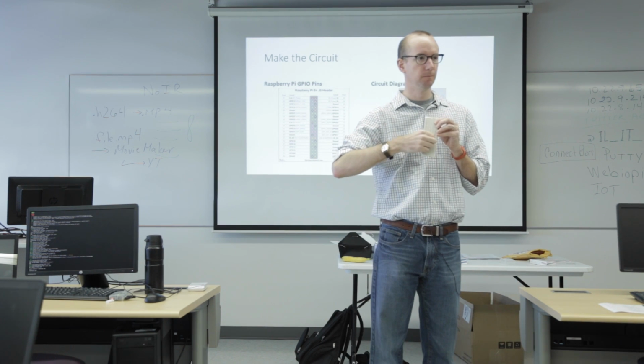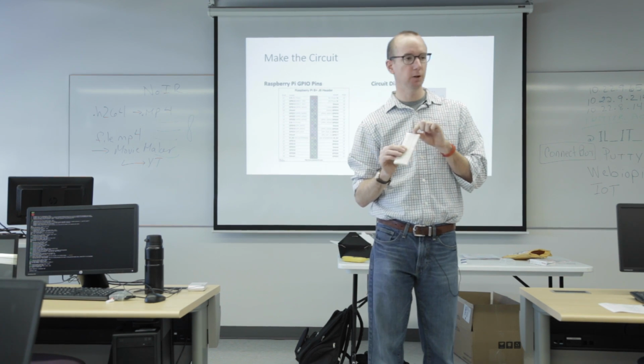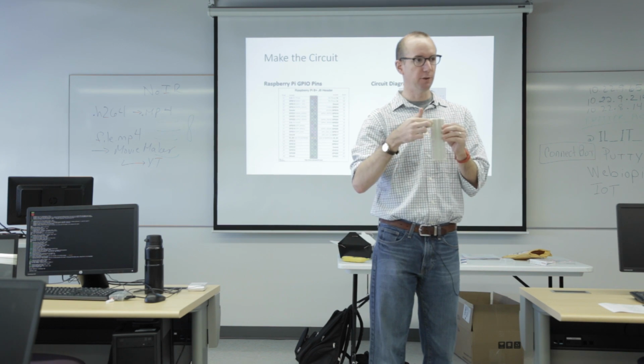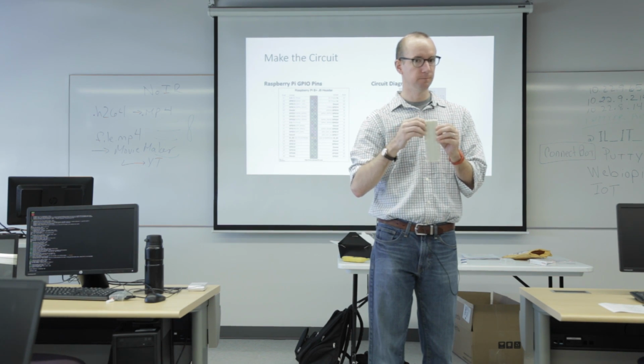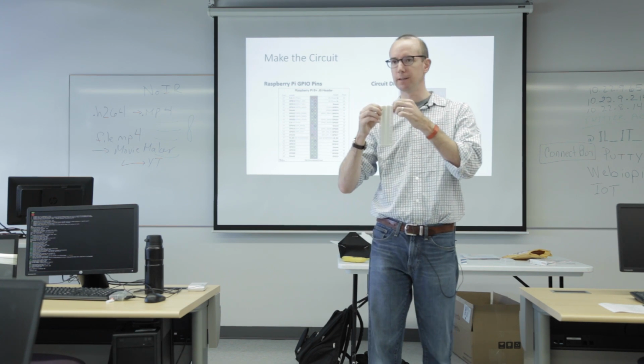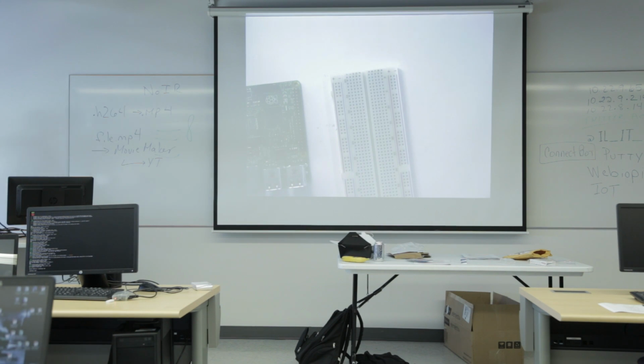Across this breaker, that sort of is a break in the line, so that these 5 here are in electrical contact with each other, but not with the things below it and not with the things on the other side. And then it just repeats it on the other side. This blue line all the way down, those are in electrical contact. The red line all the way down, those are in electrical contact.